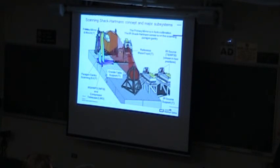Now, they have a process for doing this now with mirrors. They work on it and use profilometry, which is kind of a low resolution measurement. I'll show you some comparisons of it. It's very time-consuming metrology. They figure out their map, do their polishing, get it as good as they can, and then bring it all the way to an optical surface and test it interferometrically, with an optical method. And they discover that, shoot, there's all these low regions. We've got to go back to grinding. Well, what I didn't tell you was it took a month for them to polish it in order to be able to test it. So that whole process for these mirrors was predicted to take about 3.5 years. It was not a fast process.